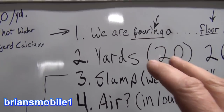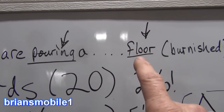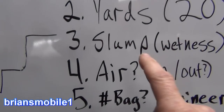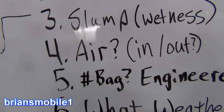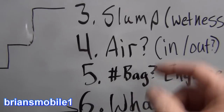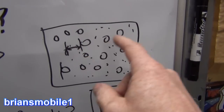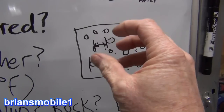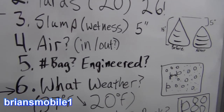The main thing in your order is: what are you doing? We're doing a floor and we're going to burnish it. If the concrete people know that, they know you don't want to put air in it. If your concrete is going to be outdoors — like a driveway, sidewalk, or barn floor that's not heated — then you do want air in it. These are micro tiny little bubbles that work like pea gravel or rocks, creating a space that acts as a compression and expansion cushion so the concrete doesn't crack as much when it's heating and cooling.